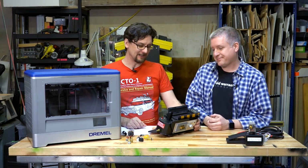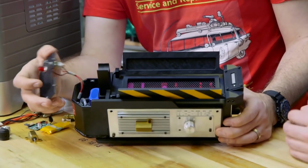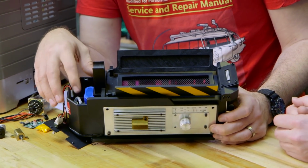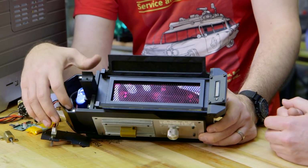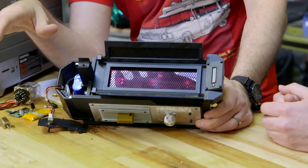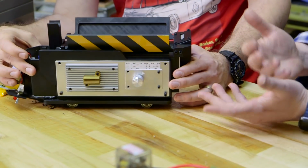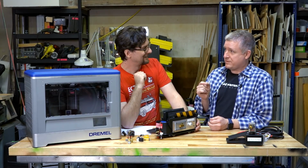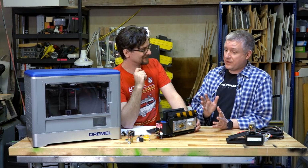Yeah. We did things like, the back panel here is magnetic, so that it can be removed. And in here, we have a 3.7 volt LiPo battery, also from Adafruit. And we have a boost board, which brings it up to 5 volts so that it'll run all the Arduino and the other electronics. So Arduino is a 5 volt platform. So we had to use this boost board, which gives you 1 amp at 5 volts, coming up from the 3.7.